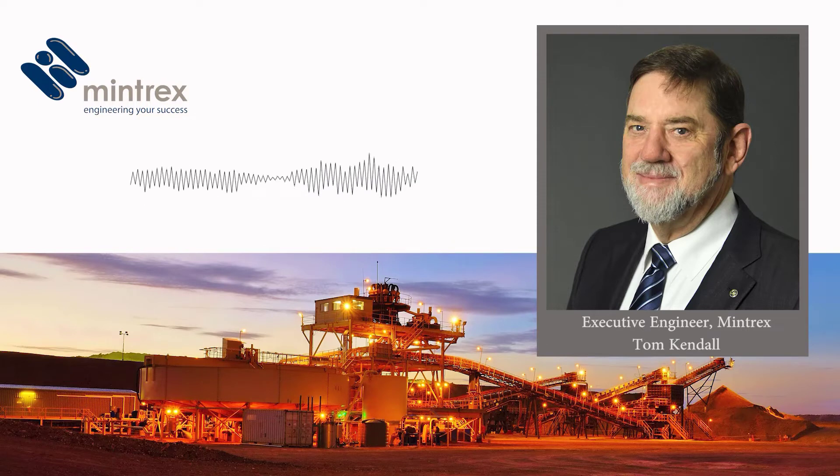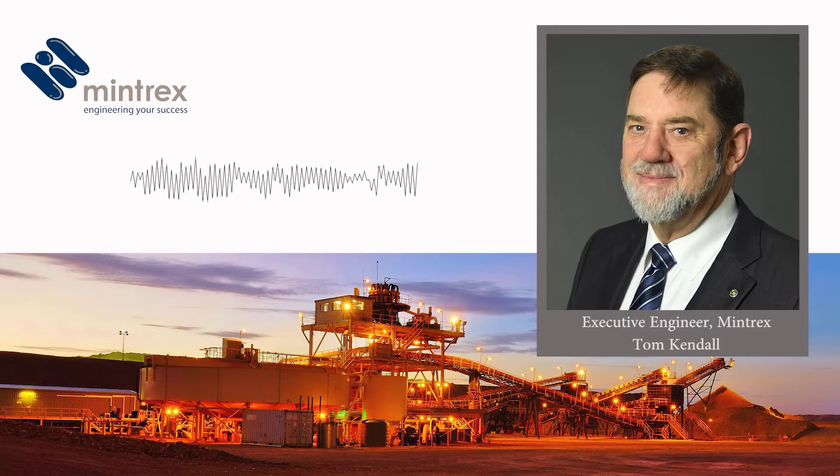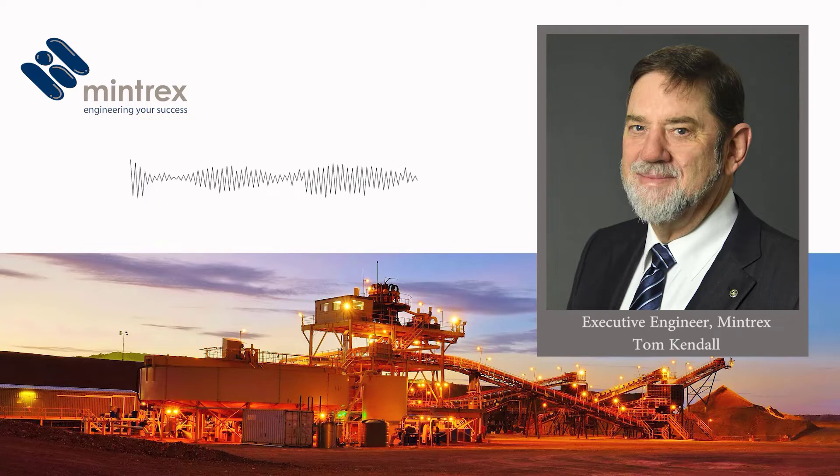In applications up to about four to five million tonnes a year, that seems to be the crossover now — used to be around two million tonnes a year, but these days jaw crushers are commonly applied between four and six million tonnes a year. Gyratories come in at around four to six million tonnes a year. A lot of projects have only one stage of crushing — the primary crushing produces a minus 250 mm product that goes straight to a semi-autogenous grinding mill. Through the 90s and noughties, that was very much the preferred approach.